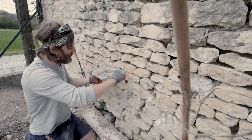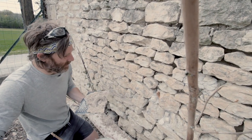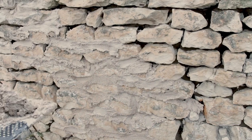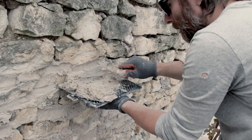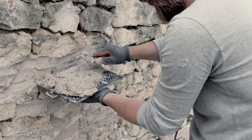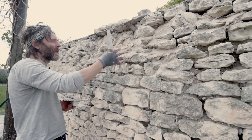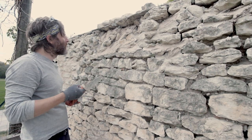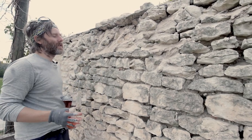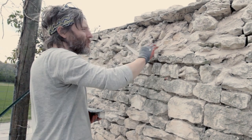The style is a lot more rustic — it's not perfect but it will do the job and it will seamlessly flow in with the stones. Up here there were a lot of vines, and as I ripped the vines out they took the stones with them, so I've had to rebuild slightly. It's really important that you don't just pack it all in — you need to build it up and let it dry in layers. I've done some yesterday and some this morning and it's still drying.